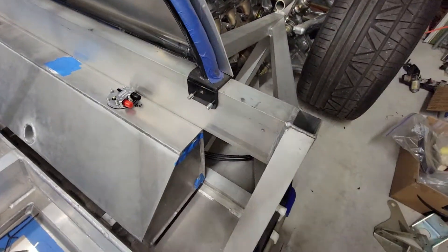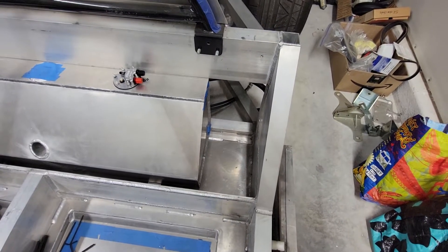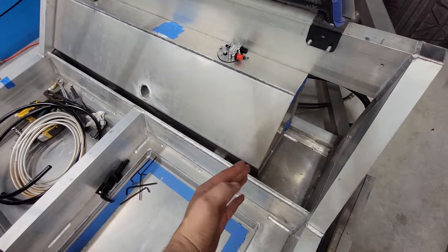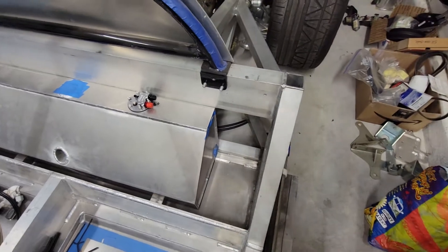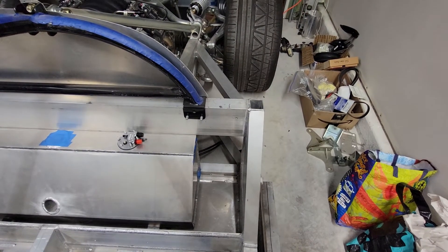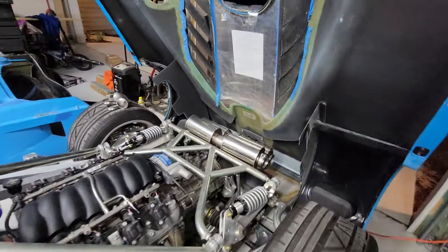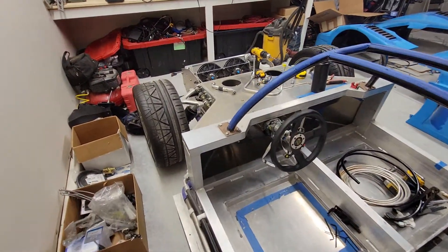I've sized out a 24F standard battery which will fit nicely right there. I'll cut a window in the interior and put a panel cover so I can quickly access the battery if needed — for a battery shutoff or disconnect. I'll probably do an automated battery shutoff with my Compustar system. That's about it — I'll probably wait to do another video until I have some meaningful progress, but for those asking how everything was looking, this is it.